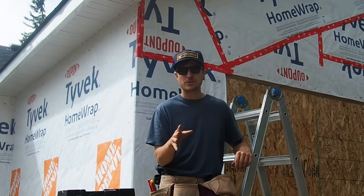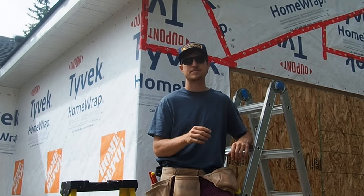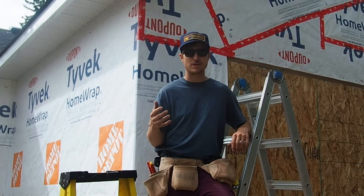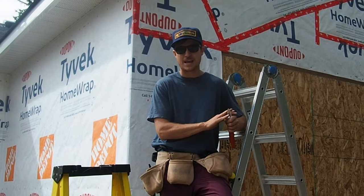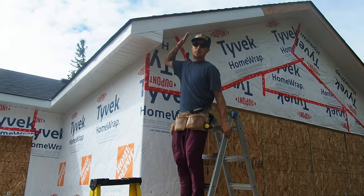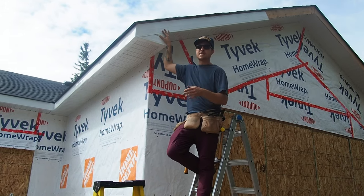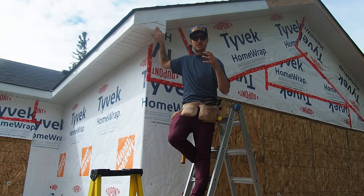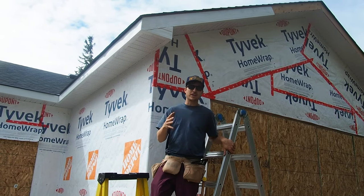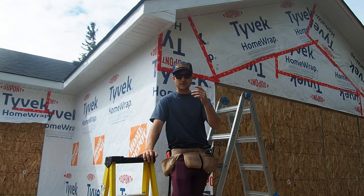You're not going to cut straight lines no matter how good you think you are. Second, get yourself a good set of tin snips — they will make your life a whole lot easier. It doesn't need to be the ones made specifically for fascia and trim; a standard pair of tin snips without a bunch of play in the head will be fine. Third, think about how water is going to move when it hits your garage, shed, playhouse, or house, and make sure you have the proper overlap to move that water away from your structure. On that note, thanks a ton for watching — that brings this episode to an end and we'll see you guys in the next one.